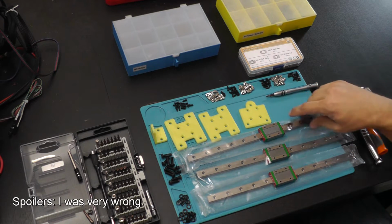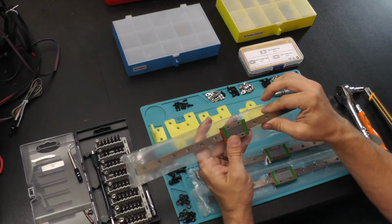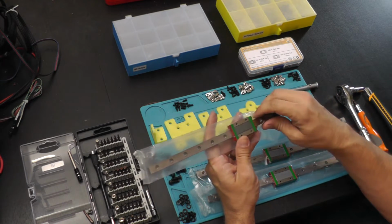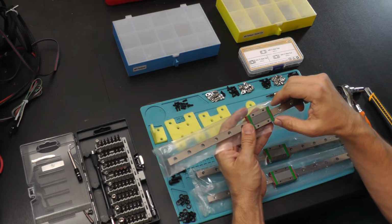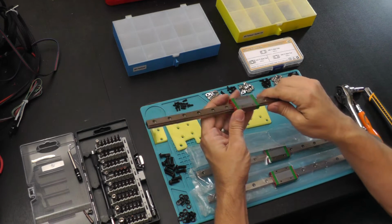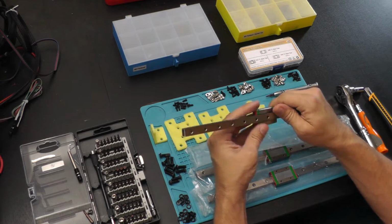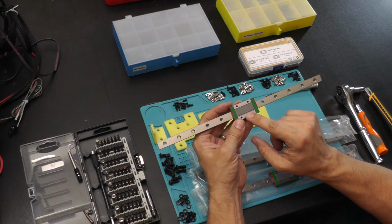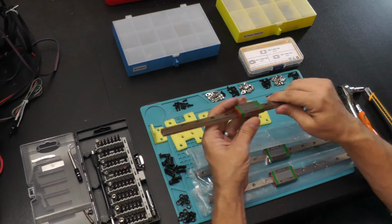Let's start out with the linear rails. These rails, as I said, I purchased off of Amazon. I will include the link in the description to where you can get the ones I bought. These are 12 millimeter linear rails, MGN12, and these are the MGN12H carriages. Keep in mind there are two carriages: there's the 12H and the 12C carriages. I'm using the H to fit my adapters.